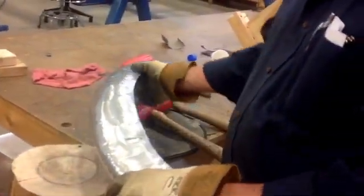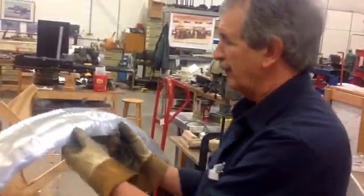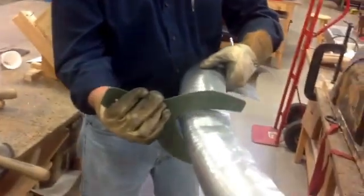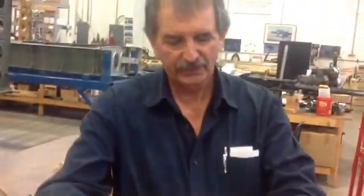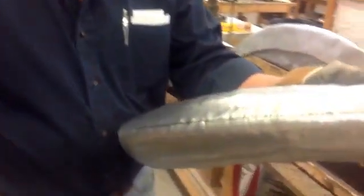So this is the stretching area and this is the shrinking area, with the result being an arc or a curve. Not only do we have to have the arc and curve match this form, we have to take profiles and match the profile this way. As you can see, this profile is fairly close, whereas this profile needs some work. Hopefully we'll work towards that and have these profiles matching — this will be the larger of the two wing tips.